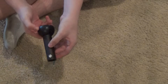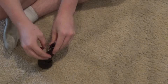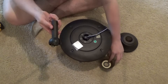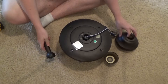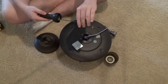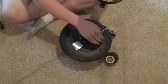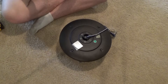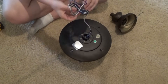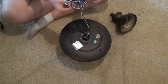Once you separate the bracket from the canopy, you have your down rod. Depending on your install, you may have a longer down rod, and you can buy differing lengths at Lowe's for almost any ceiling fan. Remove the safety pin from the down rod. We're going to take the down rod and assemble it with the big and small canopy pieces. Start by removing the green ground wire from the down rod, then the large canopy goes on the down rod this way, and the smaller one goes on in the opposite direction, sandwiching the down rod.